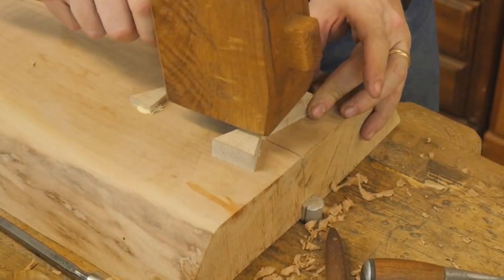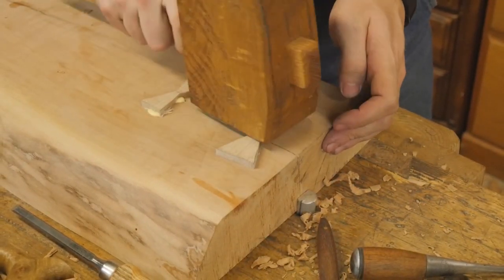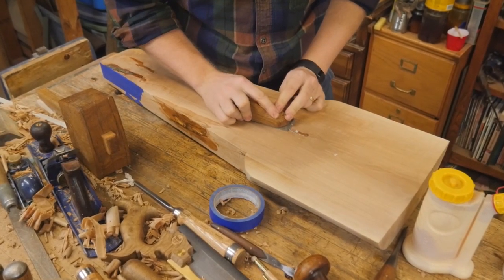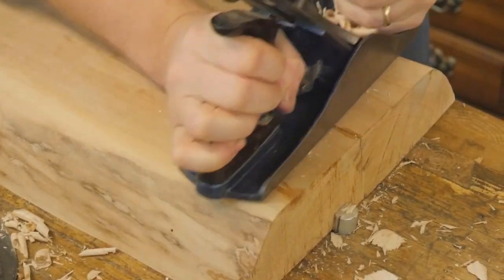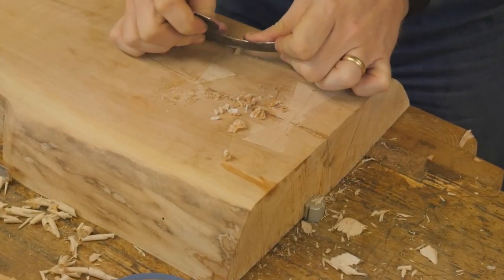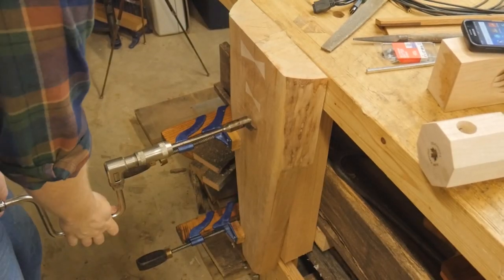Then you can apply some glue and pound them into the shape. I ended up making one a little bit too tight — split out a little bit at the corner — but I really like how it came out; it's a very good, tight fit. I used some epoxy to fill in cracks and a couple of bug holes. A chisel plane I made recently will clean that up nicely and make things smooth. The bow ties need to be smoothed out as well, and a plane works fairly well to get them down close to the surface. But because the grains are going at 90 degrees to each other, a card scraper is actually one of the best things to come in and clean it out.